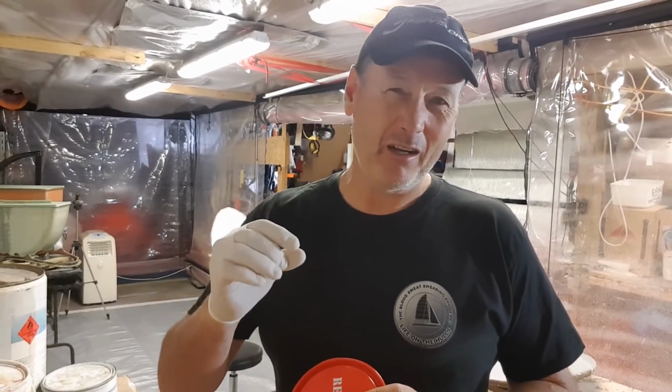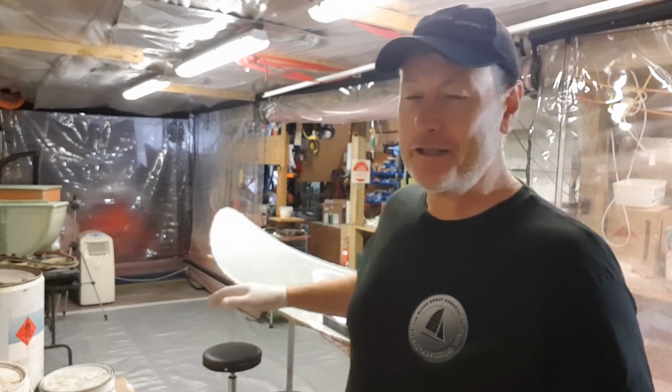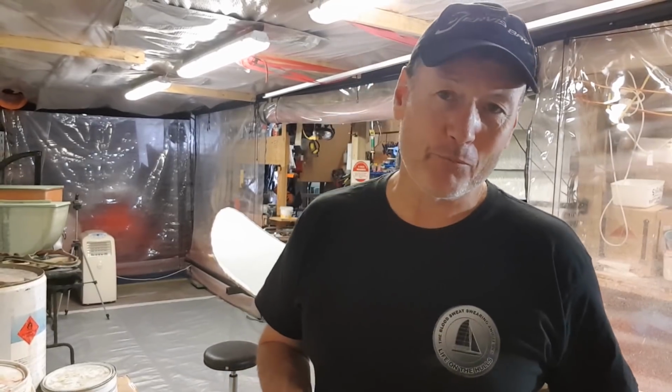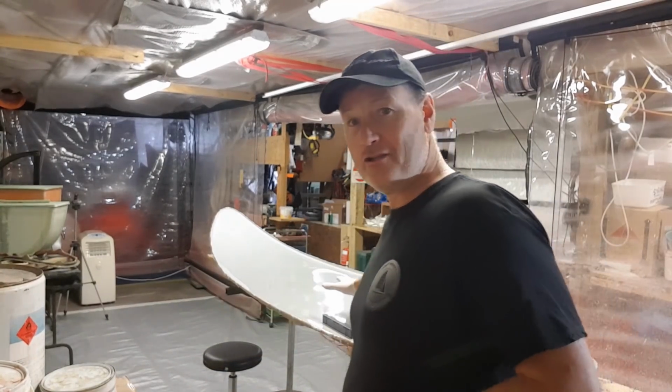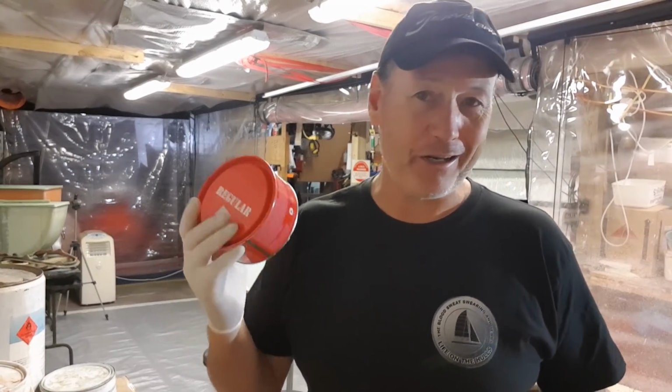There's a general rule when laminating by hand that you don't ever lay down any more than 1800 grams of material per square meter. That's very important, and that is pretty much a rigid thickness that will give you around 2 or 3 millimeters of laminate. In this case, I'm going to be laying down less than 1000 grams of laminate, but I'm also going to be incorporating a core into it, which is around a 1 millimeter core mat. The idea is I'm just getting that little bit of rigidity under the seat section, which is right in the center of the mold here. So importantly, use a high temperature wax, not just any old wax, not just any old car polish or anything.